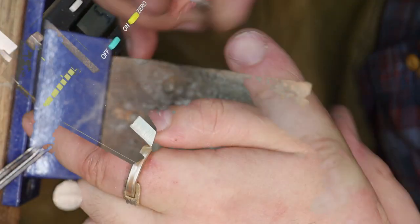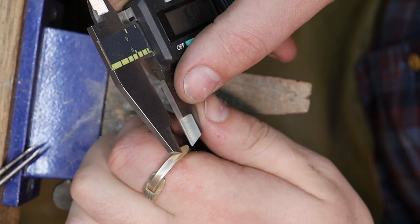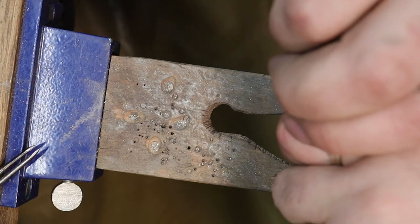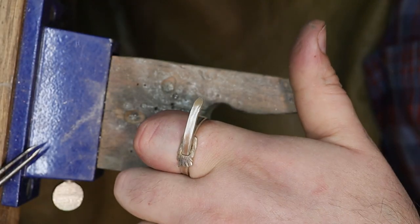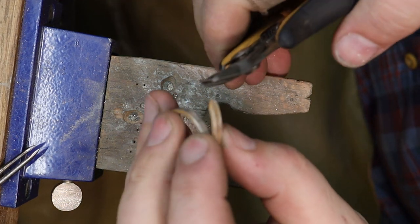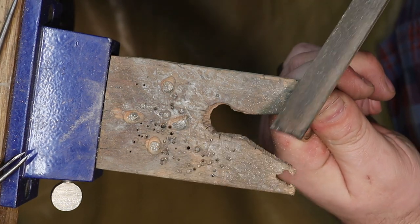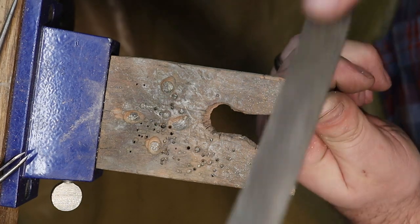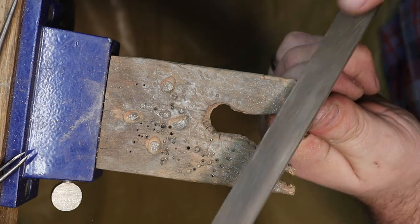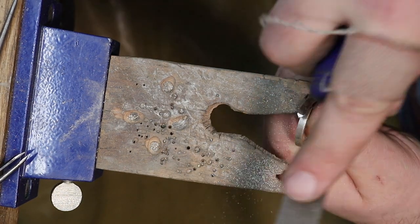I put it on. I'm gonna take about 6 mil off. So I'll just mark that there. And then what I can do is just bend that up. Well, it's still in place. I'll grab my flush cutters. I'll lop it at that line, and then I'll reform it using the pliers. I'm gonna taper it down too, because I want to try and get that to blend in with the band. I don't want it super blocky where that kind of tail, belt tail comes in.